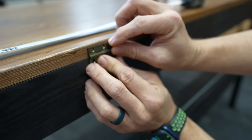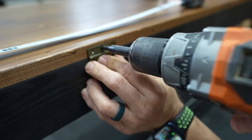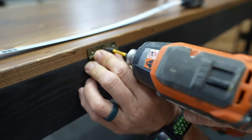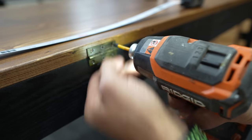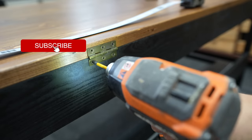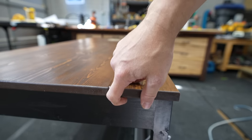For the trapdoor, we're going to attach it with two-inch narrow hinges — this will keep everything very minimalistic. Make sure you pre-drill those holes because you don't want anything splitting at this point. Put that on first before you attach the tabletop. If you like this build so far, hit that subscribe button and click the bell icon so you get notified of all the new content we've got coming.